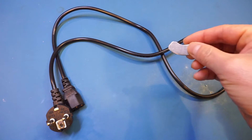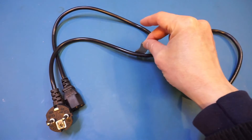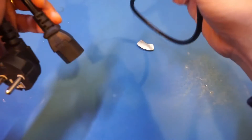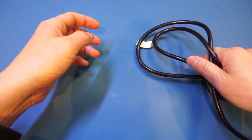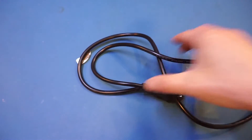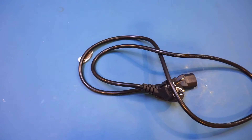Now this is what happened when I move a magnet closer to it — you can see that it's actually attracted to the magnet. You can see the magnet is stuck to the wire here, so that's not good. This means that the core of the wire is not made of pure copper and perhaps is made of steel. This is not good, as the resistivity of iron and steel is higher than that of copper. That's red flag number one.